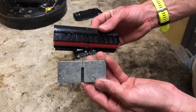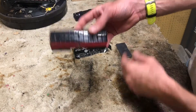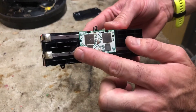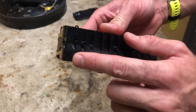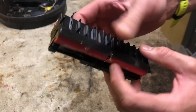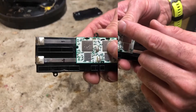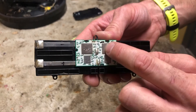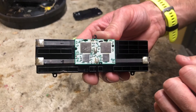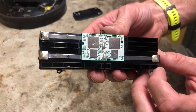Once you've got the battery assembly out, you see there's that weight right there — you can set this aside. And then here you have the battery pack. I've already labeled this one with positive and negative; it's actually on the back side as well. You can see that little minus and that little plus right there, showing where the negative and positive sides of this battery are. Now although these are the two main terminals right here, you can't actually test the voltage across here with the battery out of the Roomba.